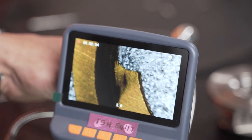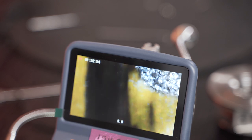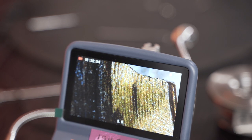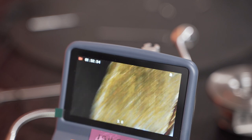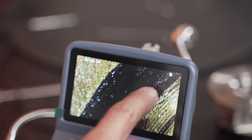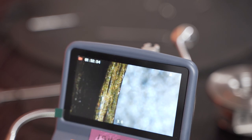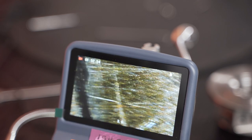So what you're seeing over there are the striations worn into the face of that thrust pad from the thrust collar, the steel collar. Really interesting. Let's keep going. That section of the thrust pad over here, past those striations, appears to be untouched. And they are, and I'll tell you why. There you go, striations again, and then they wear away. Striations again, and they disappear again.